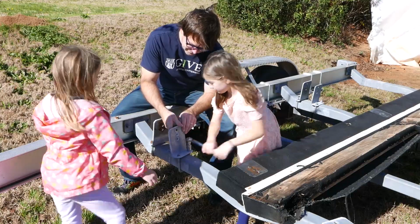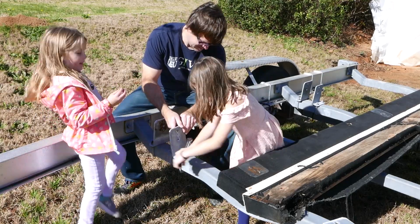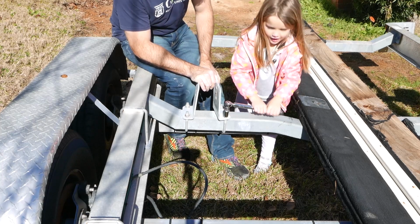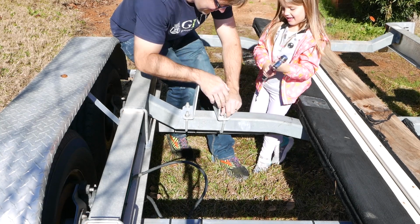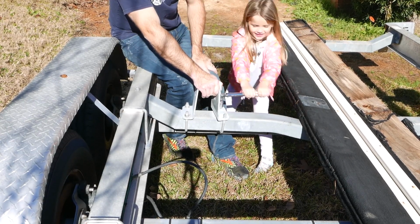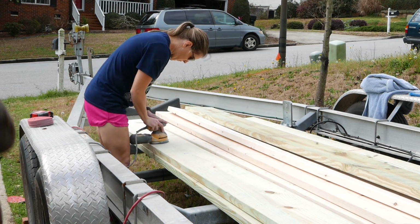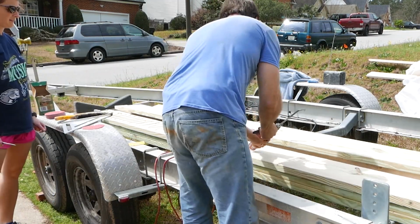While allowing the paint to cure for a week, we upgraded the trailer, installing taller bunk brackets and replacing the original rotting bunks with new ones. For the bunks, we sanded, liquid nailed, and screwed together two 12-foot long 2x10 pressure-treated pine boards to make each bunk. Together with the taller galvanized brackets, this raised the hull high enough to clear the fenders of the trailer.